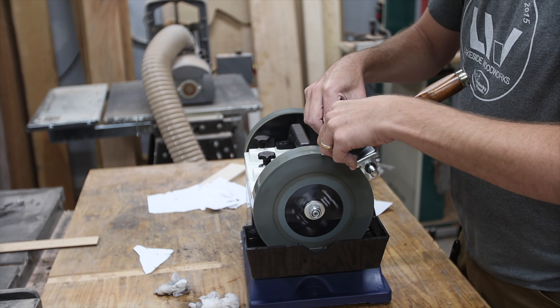I can feel that burr on the backside of it. This grinder can go either direction, which is pretty cool. Since I haven't done a ton of sharpening with a wet stone, I wondered if there's a use case for when you'd want the stone turning toward your tool or away from your tool. It turns out, if you're trying to do really quick material removal, you want it coming toward your tool — especially for rough things like axes. Most often, especially if you already have a pretty good edge, you want the stone to turn away, kind of grazing off the bottom and rolling over a nice burr that you can take care of later.